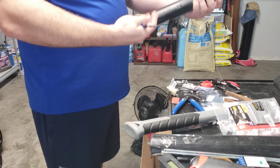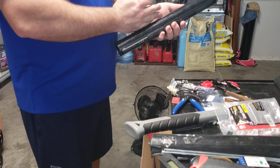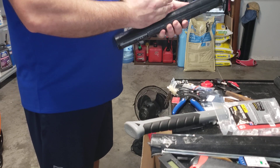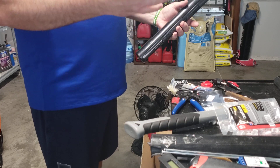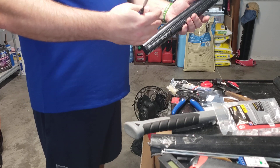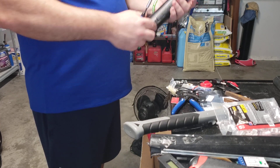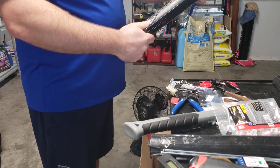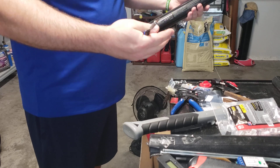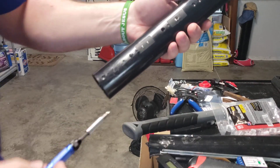These are good packs. I've got a couple that have 2600mAh cells, and yes they're Chinese brand but they're good — they're like LG batteries, 2600mAh — and they're testing on the Liitokala at 2726, 2728. Chinese or not, they're still good batteries. A good battery is a good battery.